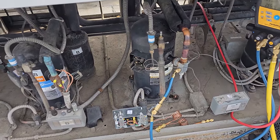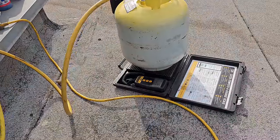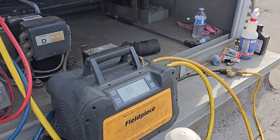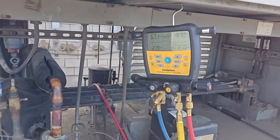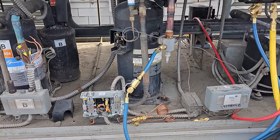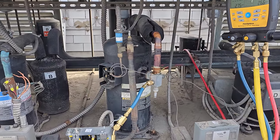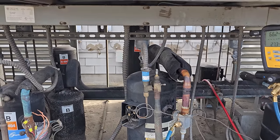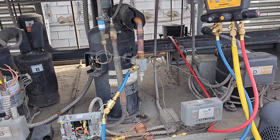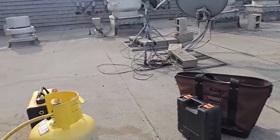It's just a waiting game at this point — we've done everything we can. We're waiting on the recovery — it's pulled out 16 pounds so far. Pressure's getting pretty high but I think we'll make it. We've got everything unhooked that we can have unhooked. We can't unhook that pressure control until we're void of refrigerant. The dryer's already a flare connection, so we're just putting a new flare in there. We already have all our materials up here so it's going good so far.